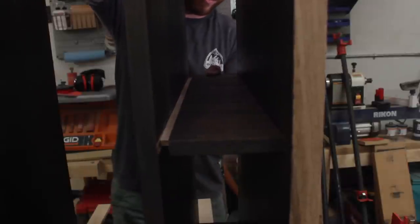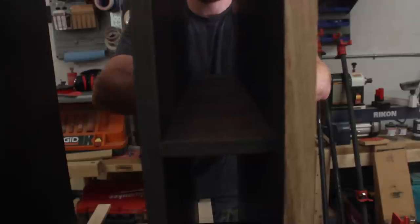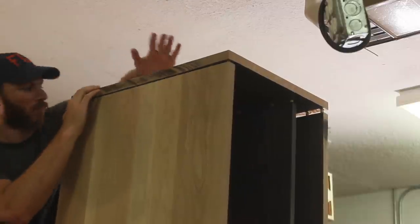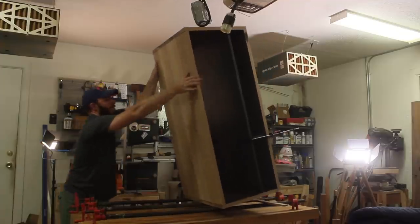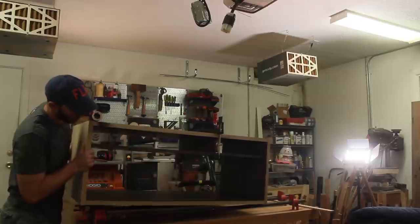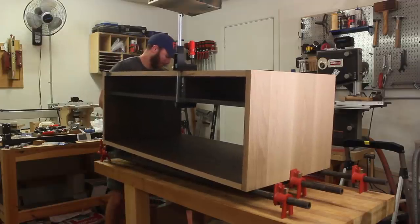Anyway, for a longer open time, I used Titebond hide glue. This glue doesn't swell the wood and lets the pieces join together nicely. I pieced together all of the panels, including the short divider and its plywood tenon. Since all of these pieces are solid white oak, this whole thing is very heavy. Assembling it vertically made sense because of the orientation of the pieces, but it also made my clamping setup a bit awkward initially. I carefully rotated the table onto its base and got started with the clamps.